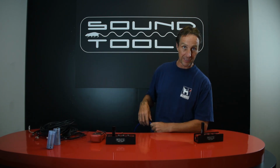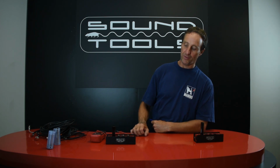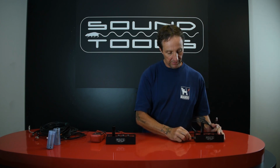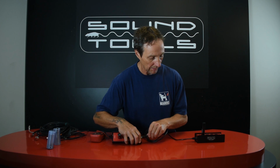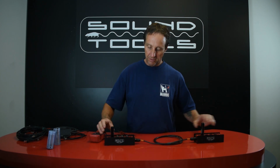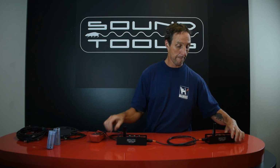What we do for testing cables, we actually load 4 XLR senders into the male side and 4 sniffers into the female side, and we use it as the XLR sniffer sender to check all 4 lines simultaneously. I believe this cable here is intermittent. Let's see what that looks like. Yeah, here we go. Here's one that's got a bad ground, so you can see that it's lighting and unlighting. Kind of fun checking cables. All right, there's one that's an etherCON that has no continuity on the ground.